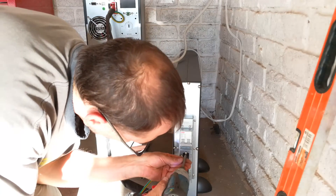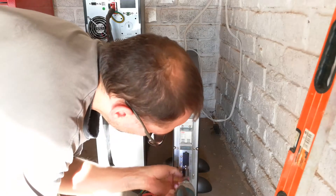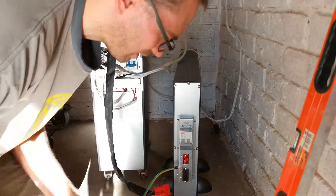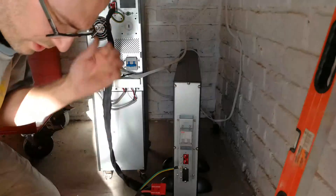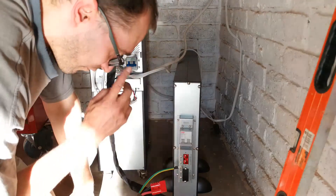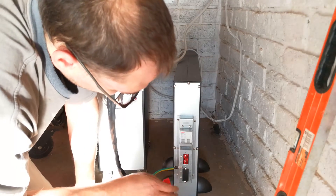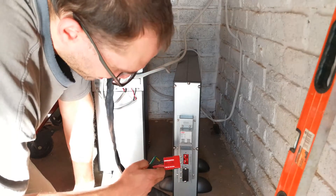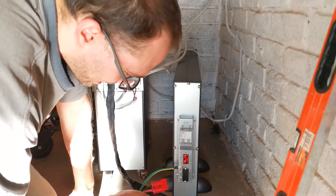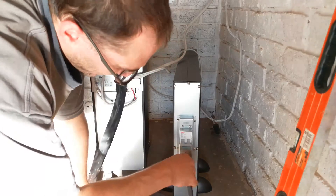There's the battery connection. On this side you'll have to open it up and start with battery connector one. Don't fool yourself — just because this is batteries and DC, don't think that you won't get a shock. Anything over 48 volts is deadly, so be aware that even though you're working with batteries and normally you don't think you'll get a shock, you will — you can really get a shock.